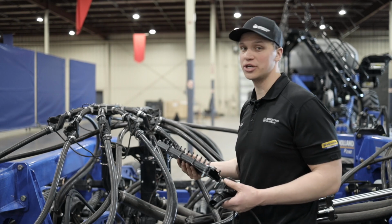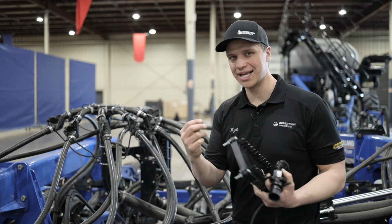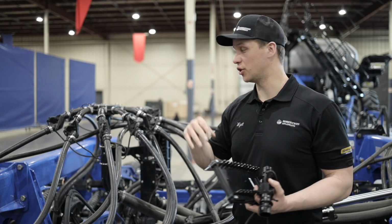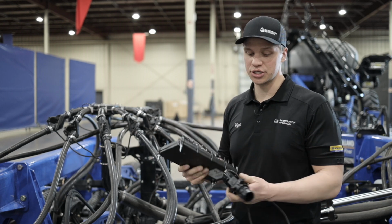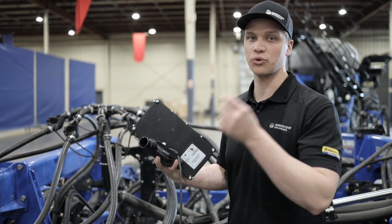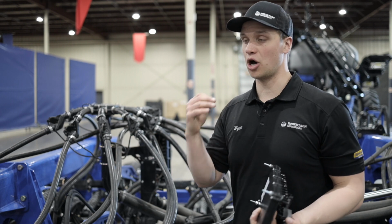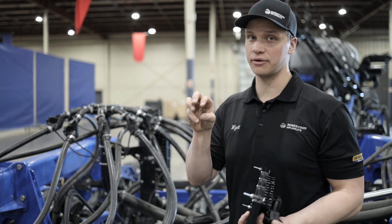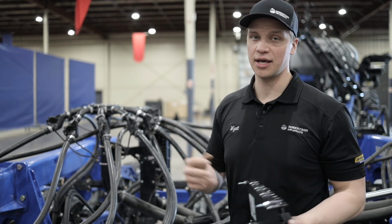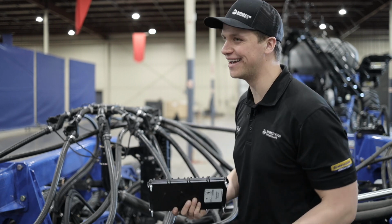The advantage to Intelligent Ag over some other systems is because it uses acoustic, there is no lens in that sensor for product to get dirty or cover, so then you're always getting a reading from your sensor. It just uses sound. So whether or not you're having seed treatment or product that dirties up that sensor, it will still record a sound and you'll still get a reading from that run. Where some of the other blockage systems use optic sensors, so they're actually looking for the flow, looking for seed. Those lenses can get dirty, product can gum up those lenses, and then you have no blockage system. So the blockage system gets blocked, as ironic as that sounds.